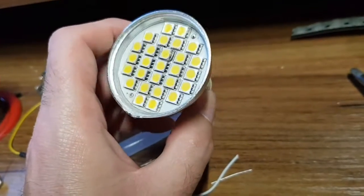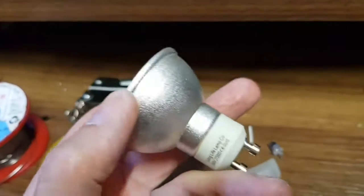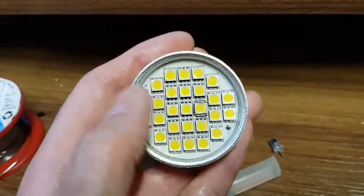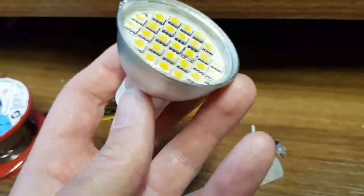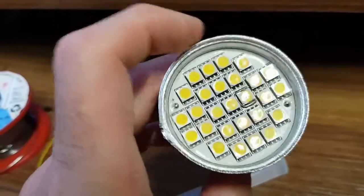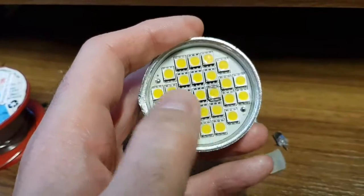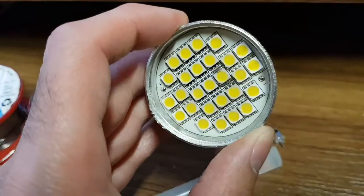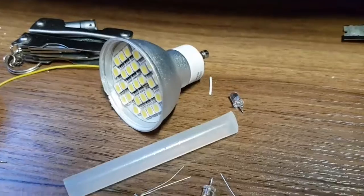People don't like LEDs because they don't live up to their 10 or 15 year infinite lifetime guarantee, but you cannot repair a filament bulb — so in a way they do have some level of repairability. The reason these fail is because in the old days they used to have really big heat sinks. They did away with the heat sinks and these run really hot, which basically cooks the LEDs. I don't expect this to last much longer because the other LEDs around it will have been cooked too, but we can get a year or two out of it. Keep posted and thank you — hope you enjoyed it and I'll see you in the next one. Bye for now.